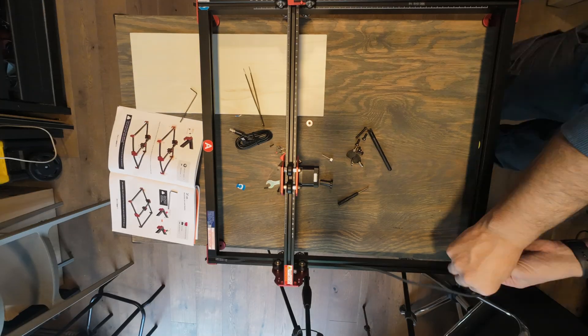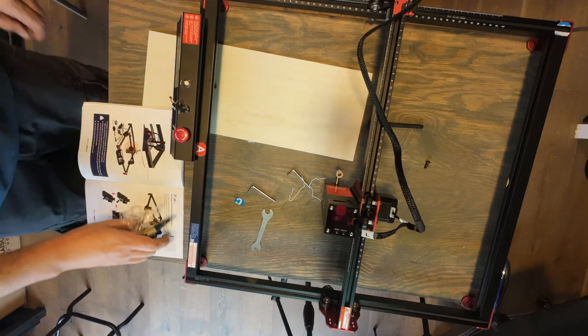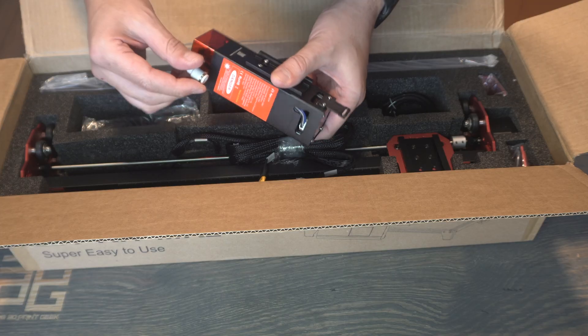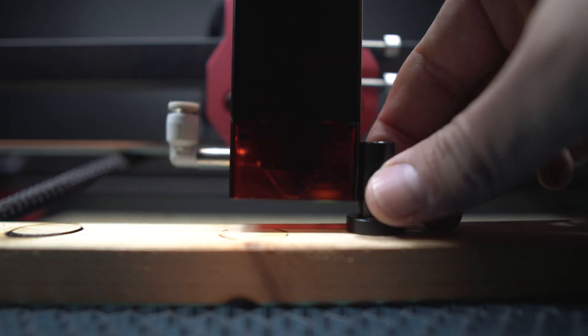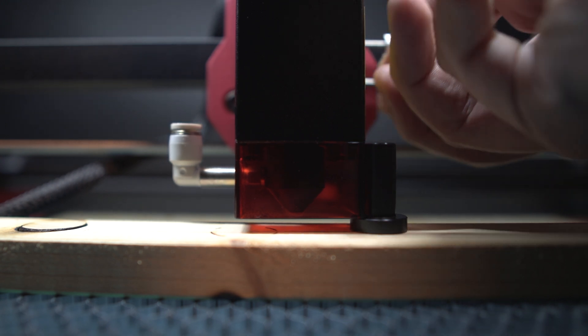It's called DIY because you have to put it together. As you can see from these images, it took me no more than 10 minutes — really well guided through the instruction manual. All laser engravers pretty much look the same: four bars for the frame, the main module that rolls inside, and strips on the side for the Y-axis to roll up and down. Very easy to assemble. The laser is 10 watts, so I wasn't expecting a lot of power, but I was surprised — the power is all there. The focusing system is very easy: just use this knob to focus the laser, lean it on top of the material you want to engrave, and start.